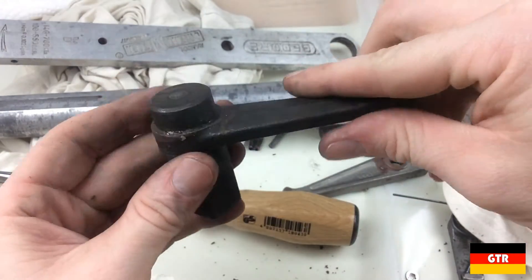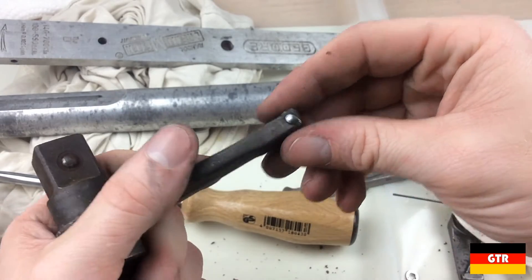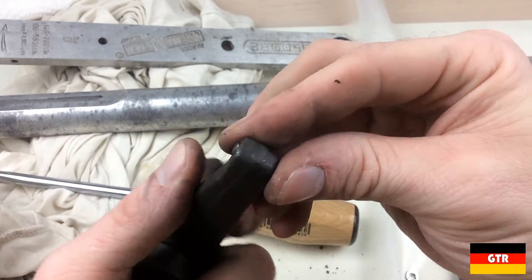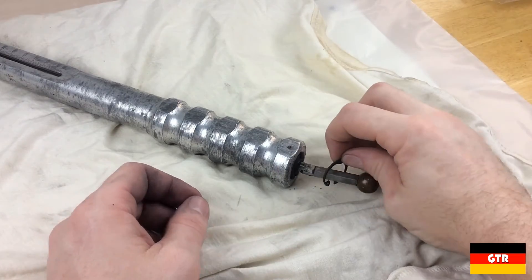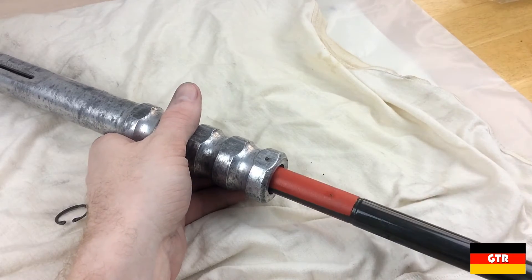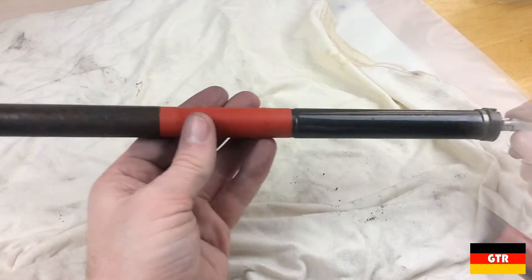If we take a look at the driver lever, it is a single piece of forged steel. It looks to have a piece of tungsten on the end of the lever that acts as a hammer as this lever meets the intermediate lever. Next, we'll take apart the spring assembly. There's a single circlip at the end of the wrench — as soon as I took this off, the tension came off the spring. After the circlip is removed, we can slide the entire spring assembly out. Inspecting the spring assembly, I was surprised to see that the calibration was not done by simply changing the position of the red tape, so there must be another mechanism for calibrating the unit.